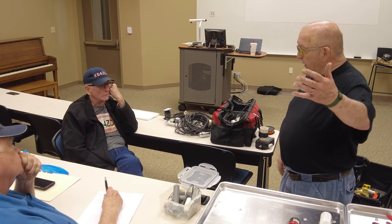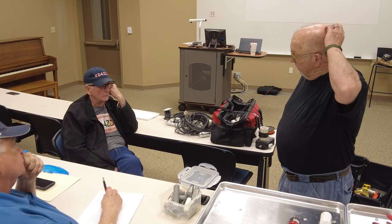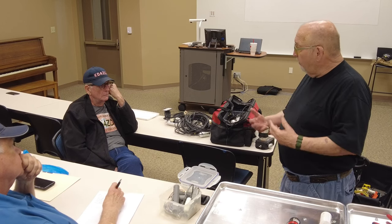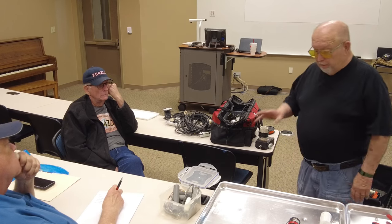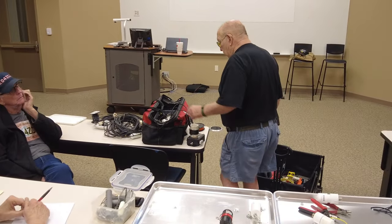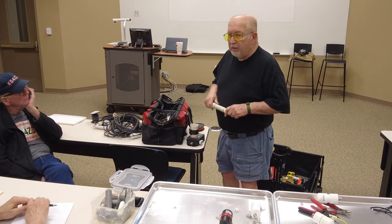Like if you've got an antenna that's like 600 ohms and you want to get that impedance down to something the tuner can handle, so you put a 4-to-1 in there and drop it down to about 125, something it can handle. Now, that's a different story. And I've got a course on baluns that we'll talk about if we want to get into them. Some of you guys don't have a lot of space.